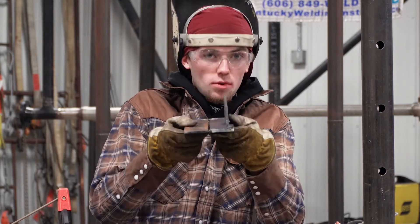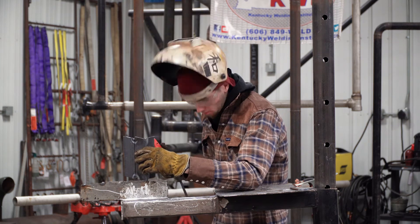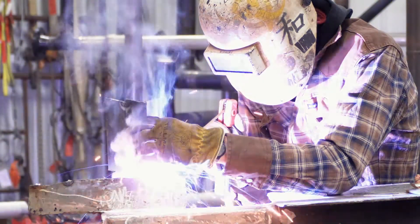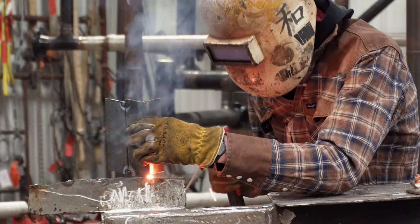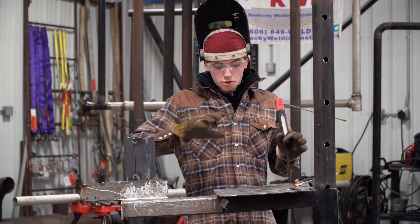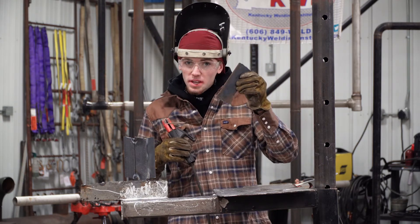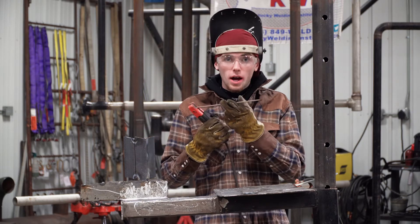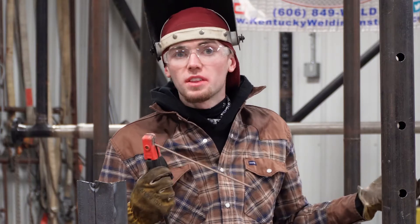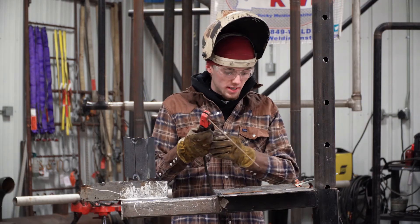I'm going to pack it up on the table — there you are. That is how you should fit up your metal; you should weld it on the stand. You also get an extra piece of metal and an extra rod. With those two, you're going to test your temperatures, because you may not be running the same machine that you would at school. So I'm going to go ahead and test my temperatures.